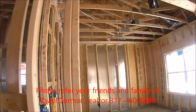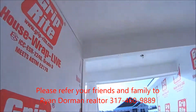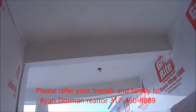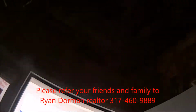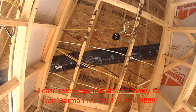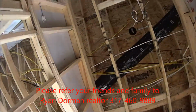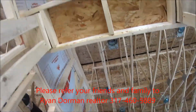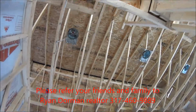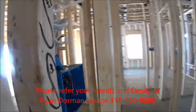Once you're inside, you do have two switches. One switch is for the light out here on your porch. Right there, that one out there. And then the other switch is for your light here in the entryway. It is a three-way switch that is tied to this light and these two can lights. They're in line. And the other side of that three-way switch is right around here in the hallway.